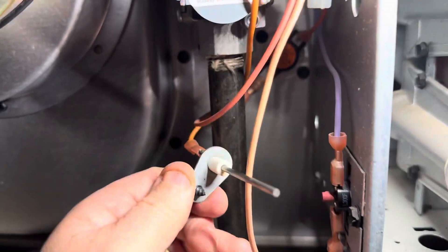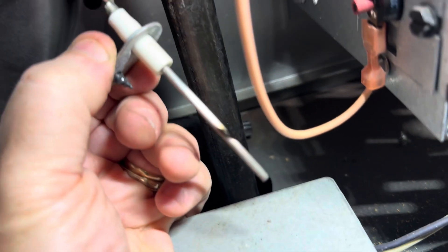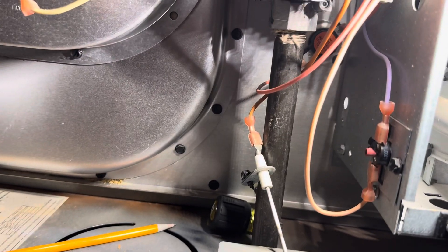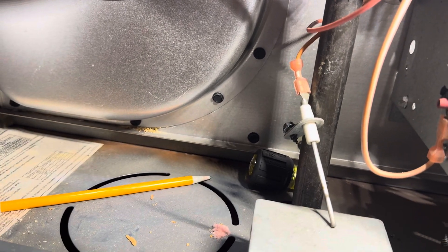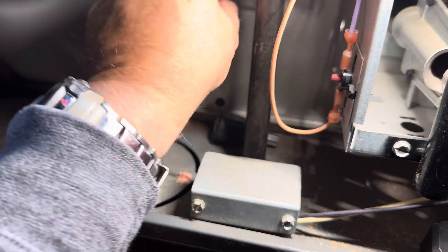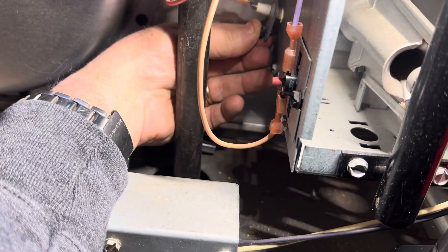It's really a safety feature. What happens is this rod will build up with carbon and not be able to sense the flame. So an easy way to clean it is to use a green Scotch-Brite like this one right here, and just clean that ever so gently. It does not need sandpaper — all we're doing is removing the carbon off of the flame sensor. I've already cleaned this one, so I won't do it again, but hopefully that gives you the idea. Then you can reinstall it.